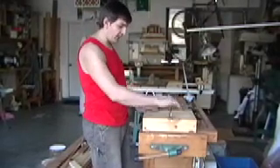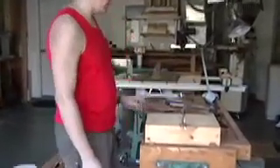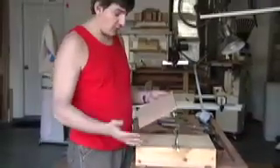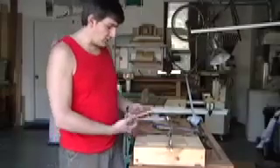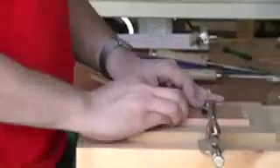Since this is a very fast clamp, I can basically clamp and unclamp things very quickly, and I don't have to spend too much time holding my piece in awkward positions or trying to stabilize the chisel. I'm also going to use a piece of medium density fiberboard which is perfectly flat. Instead of cutting directly on this pine board — which chips off very easily — I will cut on the MDF. When I destroy it, I'll just cut another piece; they're cheap enough to do this. I'll place the piece I want to chisel on top of the MDF, which sits on top of this small workbench.